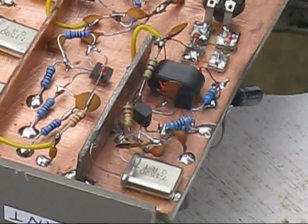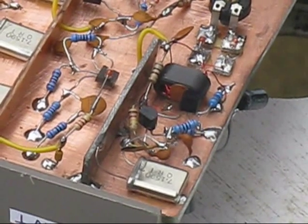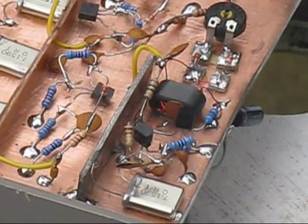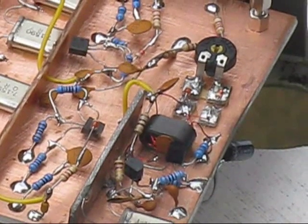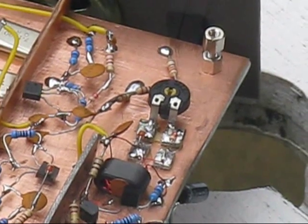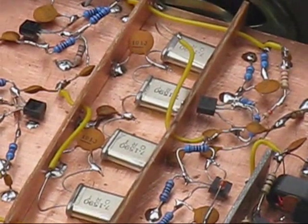Underneath, what you're seeing here is the carrier oscillator. The crystal at the bottom of the screen is for 7.159 MHz, tweaked up to 7.160. There are two BC548 transistors in the centre — the oscillator transistor and the buffer. Then there's the broadband ferrite transformer, and you can see the balance modulator, which also doubles as the product detector on receive.